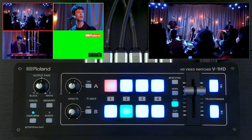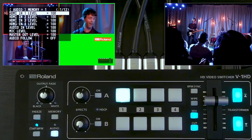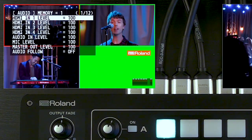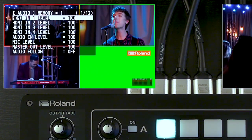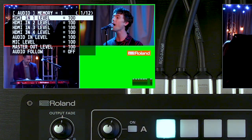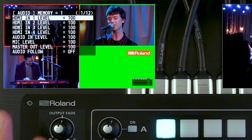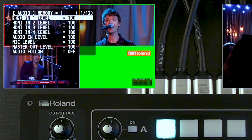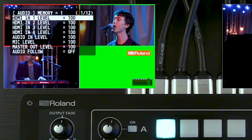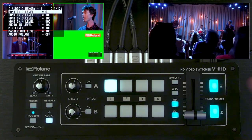I also have a digital audio mixer for both models. If I press the audio button it'll bring up a menu which gives me the audio levels, and I can also adjust the EQ settings for the four HDMI inputs as well as an RCA line in and an eighth-inch mic input. I can sweeten the audio right here in the menu or use the software to adjust the EQ as well. These are the level controls so I can mix the HDMI audio or mute it completely.